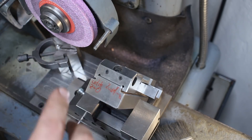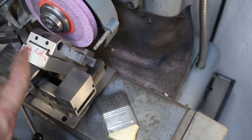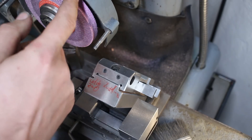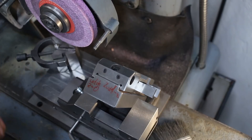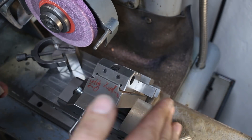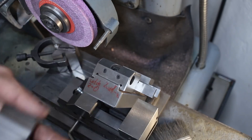The grinding is also very quick. I take a measurement, and if I'm off I just go back and grind — I can move out. I have my diamond dresser to redress the wheel after a few parts and everything's good. The parts are just held in the grinding vise at an angle, no need for a sine plate. The device is set at an angle using a sine bar. Here is one part done — nine to go.